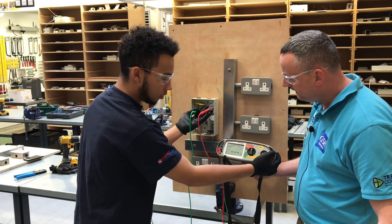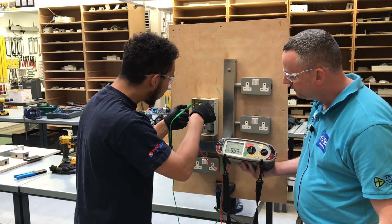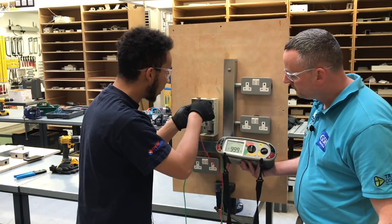In order to carry out the test, you've also left the RCCB in the off position. Because it contains what that could be damaged during this test? It's got mechanical devices and electronic devices in it.